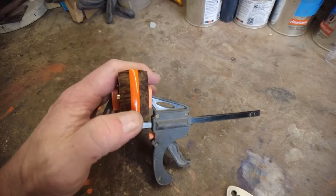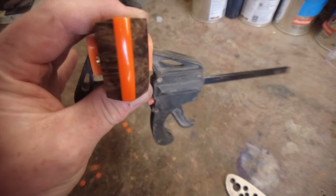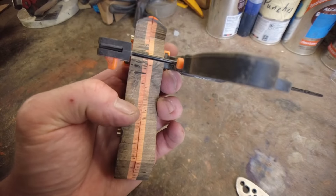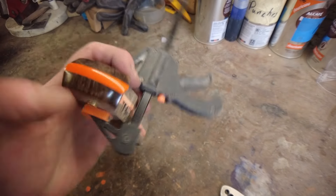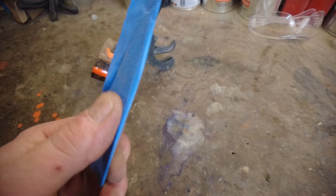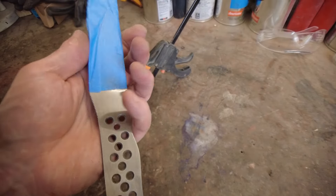The handles are sorted. I've sanded the fronts down and polished them — these are walnut burl handles with quite a nice pattern. There were a few cracks but where I've positioned the handles, by the time I sand it down they sort of disappear. I've got to put some wax on the fronts, then I'm going to put the final rough secondary bevel on, hand sand them again down to 800 grit, and then they'll be ready for gluing together.